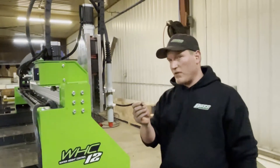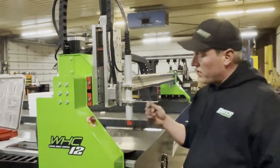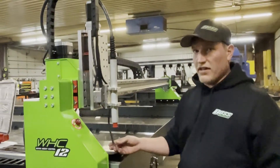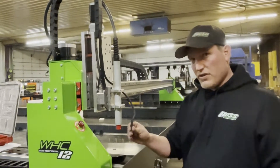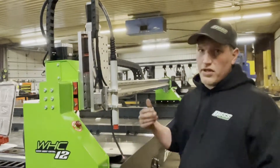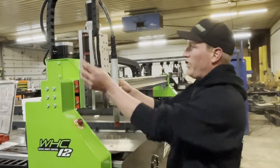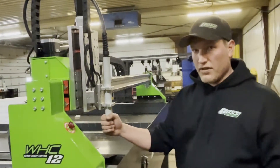What is this wire? This wire is essentially a homing switch. There's a homing switch in here, and there's also a homing switch run off of continuity — this runs much the same as an ohmmeter. When this wire and tip come down and sense steel, it sets home. You will have two configurations: new steel or feather touch. The new series tables are labeled feather touch. If you're going to run on steel that is rusty, powder coated, coated with any membrane, laser film, or any of that, you need to be running rusty steel — no feather touch — and not use the wire. Just tuck it back and use the mechanical switch right here, and this will be how you set home on your machine.